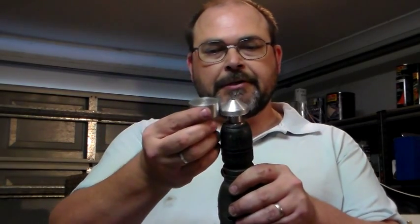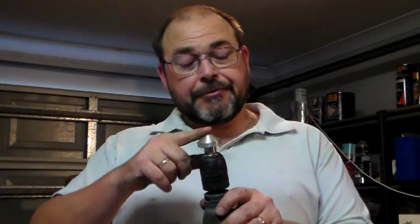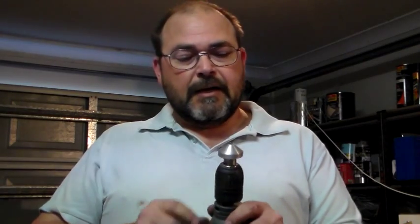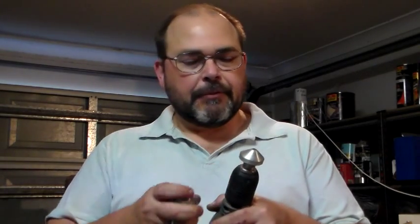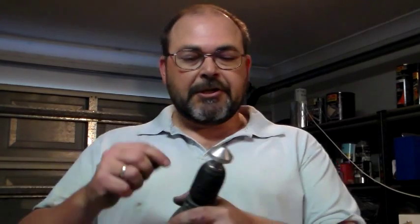So you can see I've actually turned that down to the conical shape. If you want to see how I did that, I actually did that on the drill press — one of my other videos, 'using your drill press as a lathe', loosely speaking of course. Basically what I was able to do: these already had a threaded hole in the end, so I just screwed a bolt into the end, cut the head off the bolt, mounted that in my drill press, got an old chisel in my cross slide vise, and just gradually ran it across here up and down until eventually we got this shape.